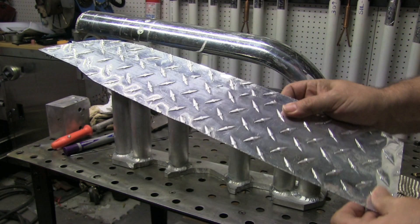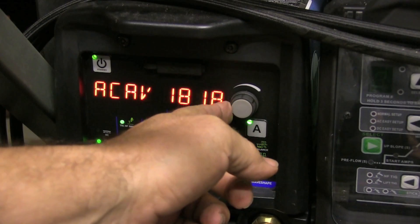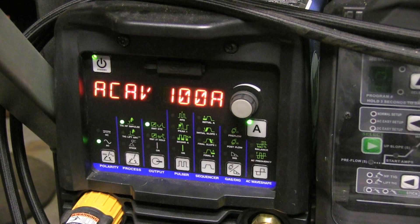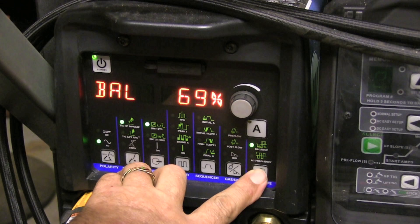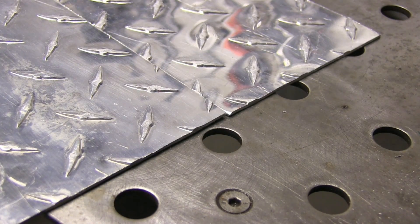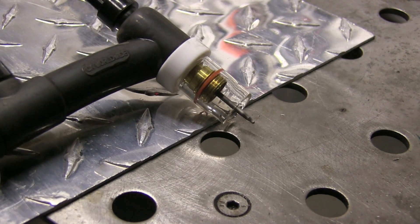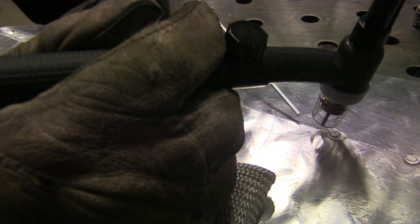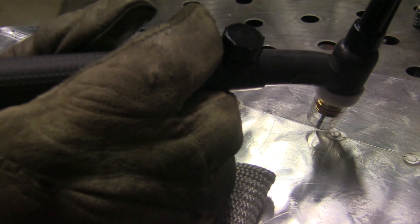This is 16 gauge — 063 thickness — and I've got a little work to do to make it fit up as good as I can. Originally he was going to go with tread plate and he decided to go with smooth. I'm kind of glad he did — I think it's going to look better with the smooth. Since I've got that tread plate, I decided to go ahead and swap torches and see if I can make a clean weld. I set it down to 100 amps, balance still at 69, but I adjusted the frequency to 100. After swapping torches, right away — nice clean puddle. I think I had a small leak in that flex lock somewhere, but all I know is this is welding a whole lot cleaner without changing much else.